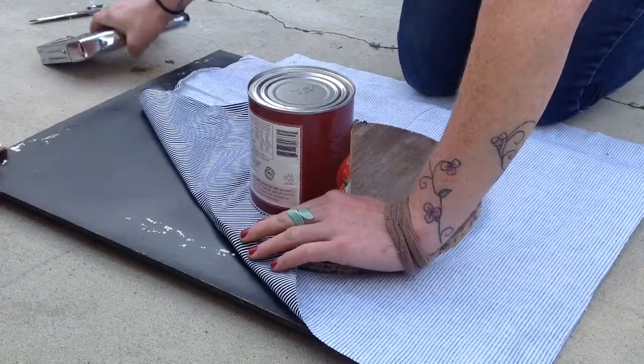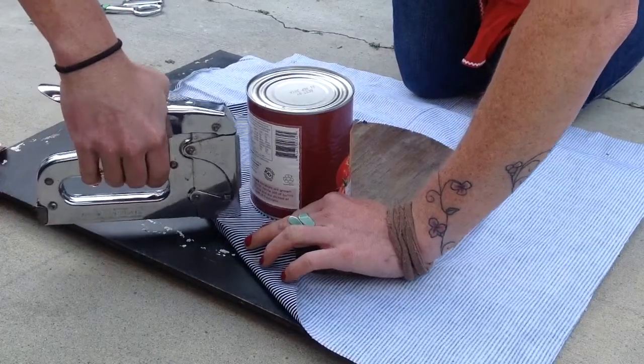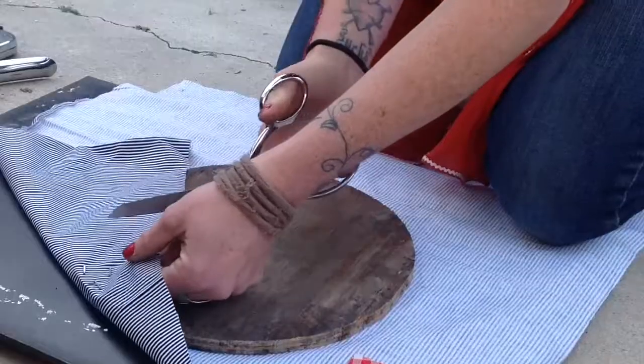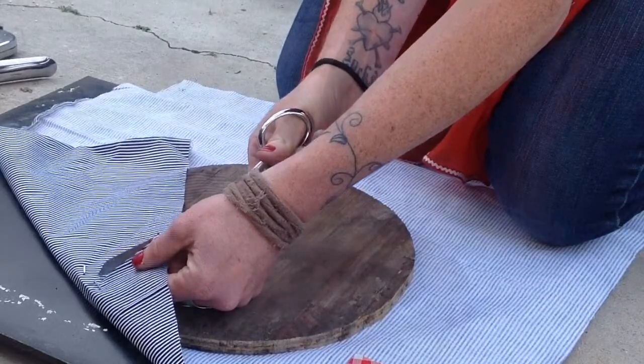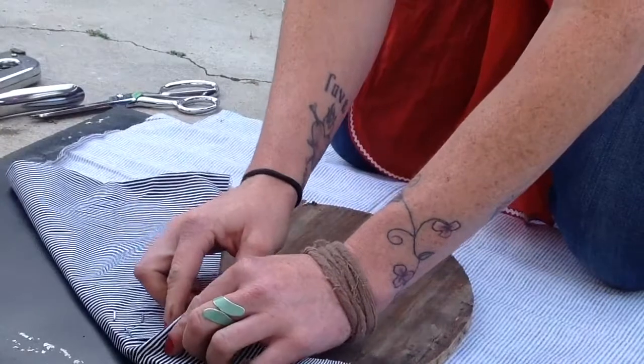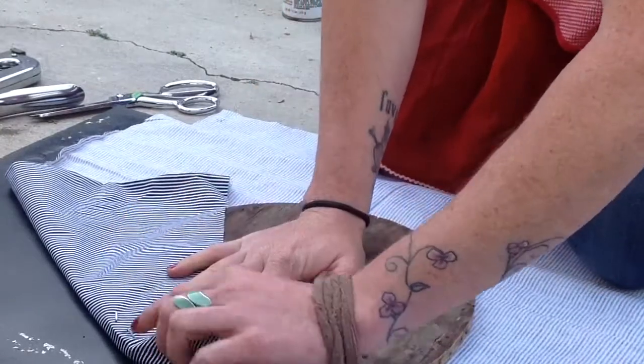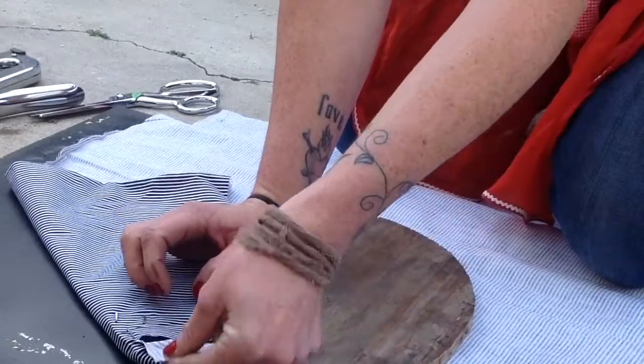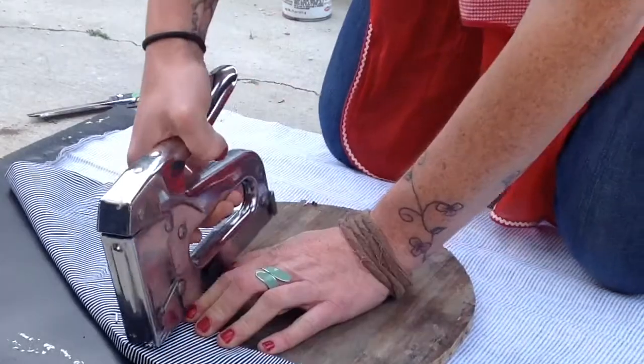Make sure you have at least 2.5 inches of material all the way around the board, which will be folded over and stapled down. We'll want to use a few staples within 1 inch wide parameter because we are going to cut strips next, going up until 1/4 of an inch shy of the edge. Fold the cut you just made over to your stapled down strip so that your overlapping bottom corners kiss. This should make about 1 inch to 1.5 inches fold that you stapled down.